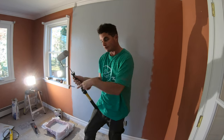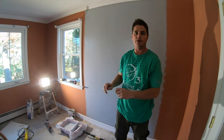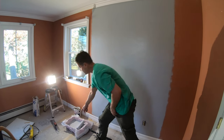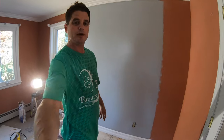I'm going to put the roller back in the tray because we're definitely going to do another coat. It's always a good idea between coats to put a piece of plastic over your paint so it doesn't start to dry — because if it starts to dry and you go to roll, it'll pick up those dried areas. If you look closely, you can actually see the slight texture the roller produces, but since this is a porous area it's going to suck in the paint.